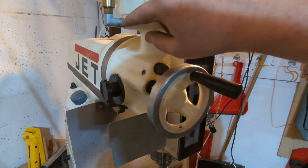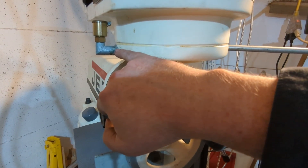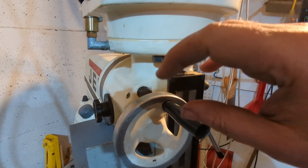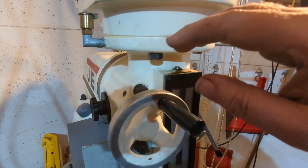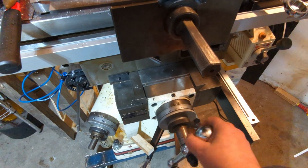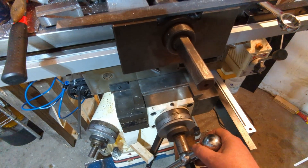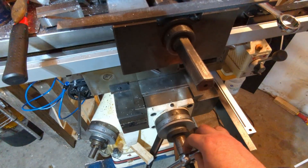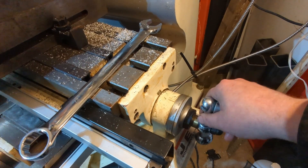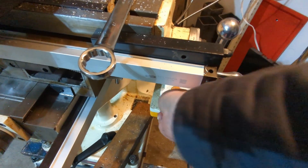The spindle oiler is like a drip feed and it was mostly just feeding the quill. So I put a wire wick inside that drips down onto a piece of spongy cloth material that sits over the bearings — I think the bearing is getting better lubrication now. There's very little backlash — I haven't done any adjustments of the gibs or anything — about six or seven thou in the Y and on the X there's a little bit more. It's got a power feed and it's functional.